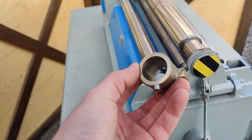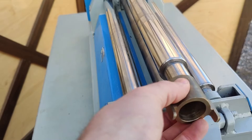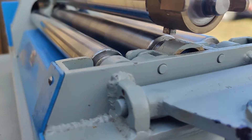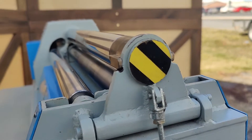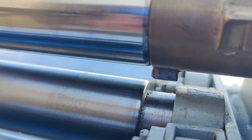Once you have a plate roll and your cone blank, the other thing you're going to need is a cone attachment on your plate roll. That is a little sleeve that fits over the end of the top roll on the drop-in side and has a snubber on it. It either has a solid steel rounded snubber, or if you get the heavy-duty cone attachment, it's going to have a little roller there that spins. I also recommend hardened and polished roll options, otherwise you can damage or scar up your rolls on your plate roll.